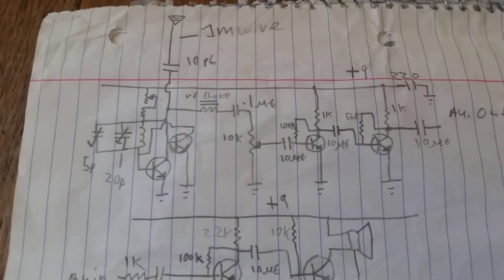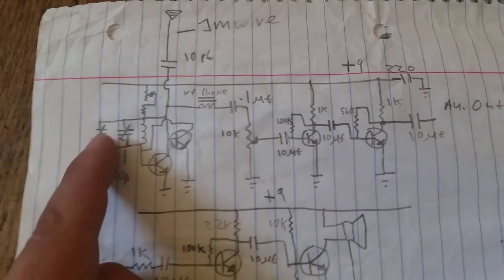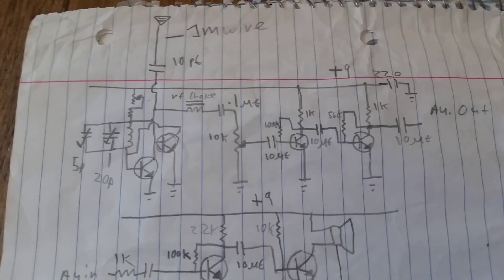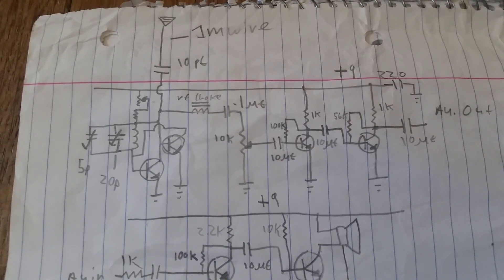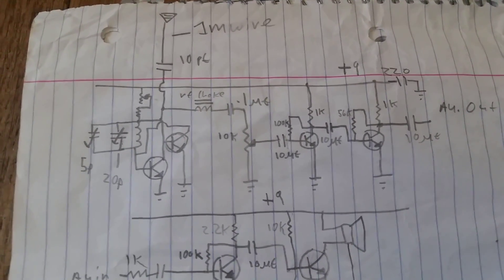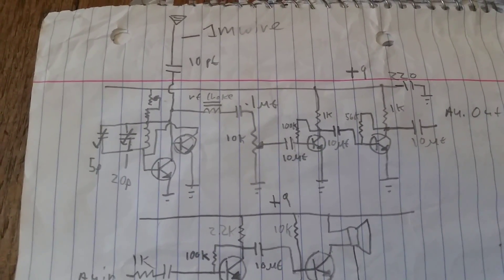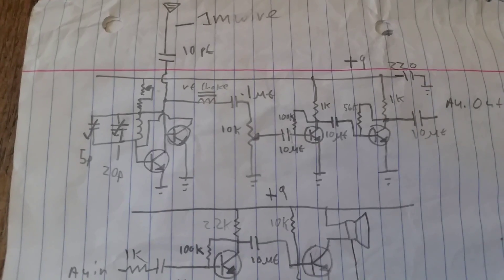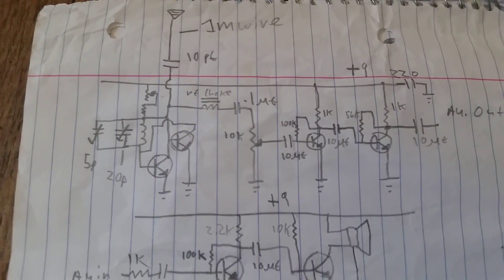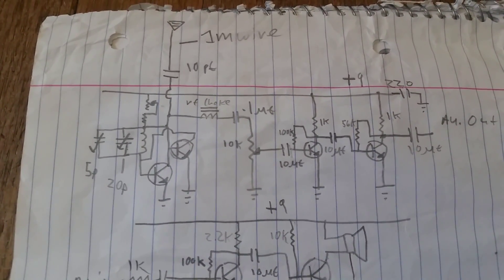Let me go through the circuit. You have your tuning capacitors, your coil, and two transistors in a weird arrangement. The collector and bases are connected together, kind of like a silicon-controlled rectifier, but I'm not sure — it works. Off of the collector of one of the transistors, there is a 10 pF cap going to a 1-meter long wire as an antenna.